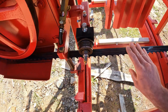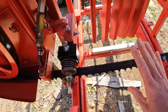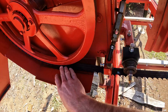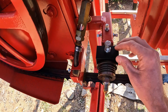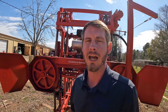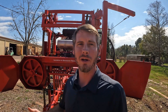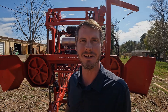So checking the tracking on the blade — start with a new blade. If the blade's got cracks in it, I hate to adjust the machine. Start with a new blade, check the tension, look at the position on the band wheels — I'm doing that first. And then I bring the roller guides to match where that blade is going to sit. Thanks for watching our video. I hope you found it helpful. If you've got additional questions, you can always give us a call or shoot me an email. If you did find it helpful, subscribe, comment, and anything else you're running into that you'd like to see a video on, just let us know.